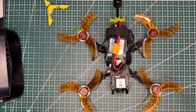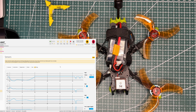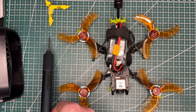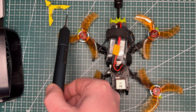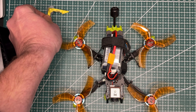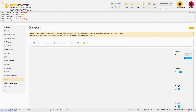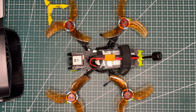I'm using a battery during this part because it's much easier to rotate the quad freely without USB wires. I'm connected to Betaflight over Bluetooth and I have the coordinate axis shown — X is pointing forward to the north, Y is pointing to the left, and Z is pointing up. Let's start our little experiment. First, let's go to the configuration tab and set magnetometer alignment to CW 0 flip, which is clockwise 0 degrees flip, because we only know for sure we flipped our GPS so that the compass is now looking down.